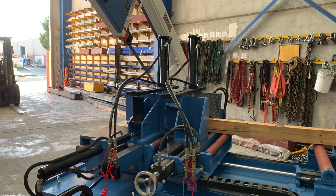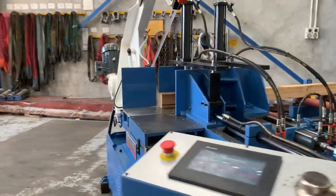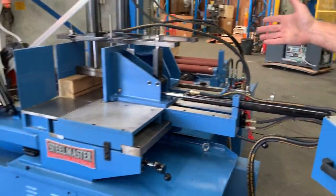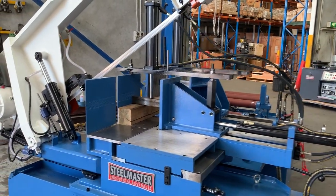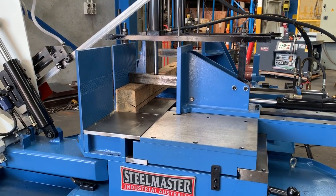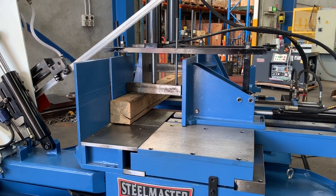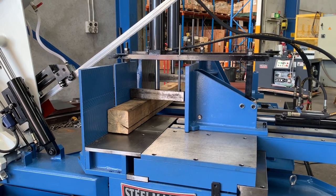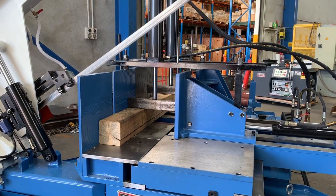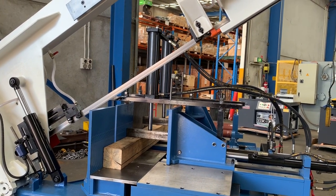We've got hydraulic carbide blade guides, Telemecanique safety switchgear, and T-cone motors — it's all high-quality fittings. Let's put this on an auto feed automatic cycle now. She's clamping, it's going to feed some material in. We've got a 100 by 100 timber section there at the moment just to show you how this works. The vice opens up, bundle clamp releases, it feeds in — we've got that set to about 150 at the moment. It'll come down, clamp, and then the bow starts up by itself. This is all NC programmable.